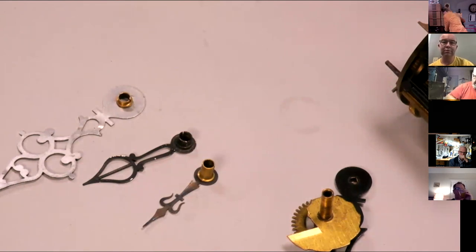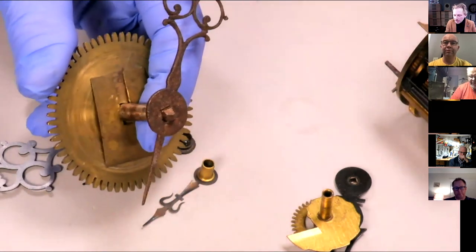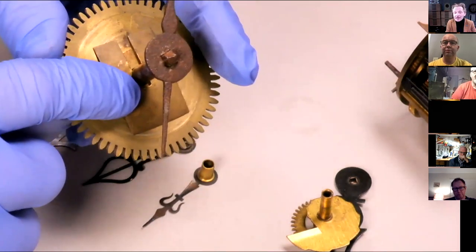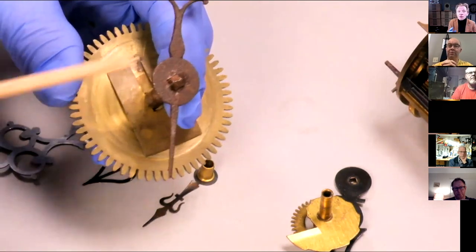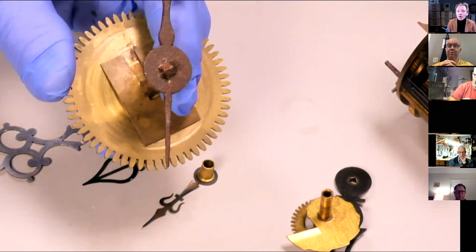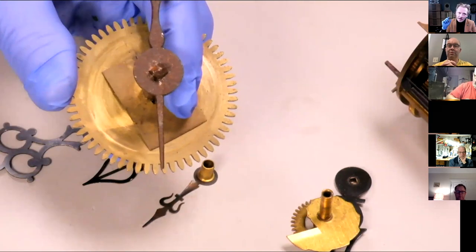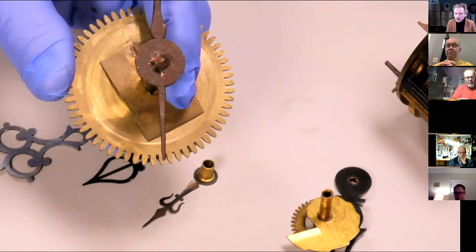Is there a little bit of the collets that has a groove across it for a pin? There are long case clock hands, if I've got it right. Like, imagine this is an hour hand on a long case clock. There are sometimes slip washers, very much like this, that hold the hand on. There are sometimes two little holes drilled through the corner of the square, and you put very fine taper pins in there. And sometimes, as we've already seen with the long case clock, there's one, or if you're working on something that's better quality, there are two screws that hold the thing on. And they're kind of all fine because those solutions are pretty easy to keep the hand held on. The problematic one is the one where the hand just shoves on to the square or round in this case, and there's nothing else holding it there other than friction, if that answers the problem.